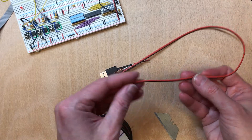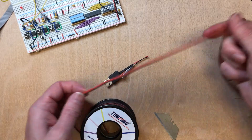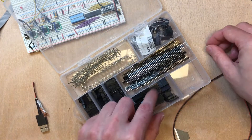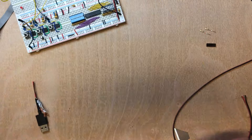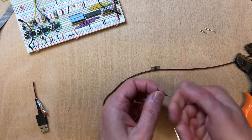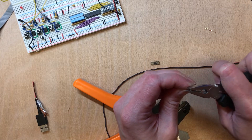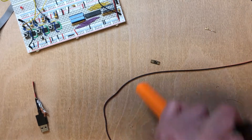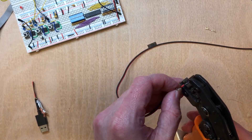To take the power to my circuit I like to use the silicone covered wire because it's really quite flexible. Now for the DuPont connector, this is the remains of a kit I bought from Amazon, and I do have a separate video on how to use one of these crimp tools. This particular set of pins has got slightly bent in transport I think — just straighten them. You want the insulation to just go into the area where it's going to get clamped.